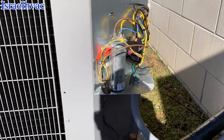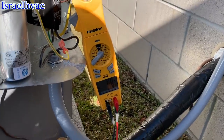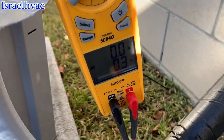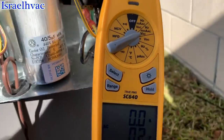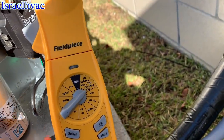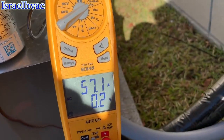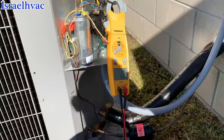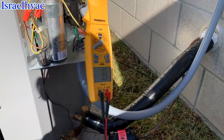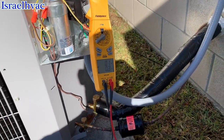That ain't good. That compressor did not turn over. Well, this ain't no good, fellas. This one's drawing locked rotor on startup. Check it out. She don't want to break free. I'm gonna try to hit it with a hard start. I'm gonna go start the other ones up first and give this one time to settle down.